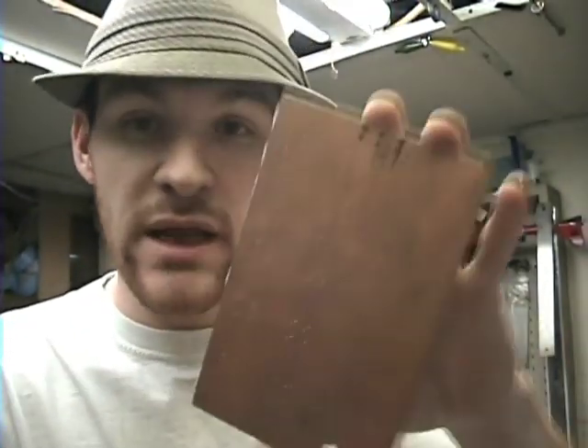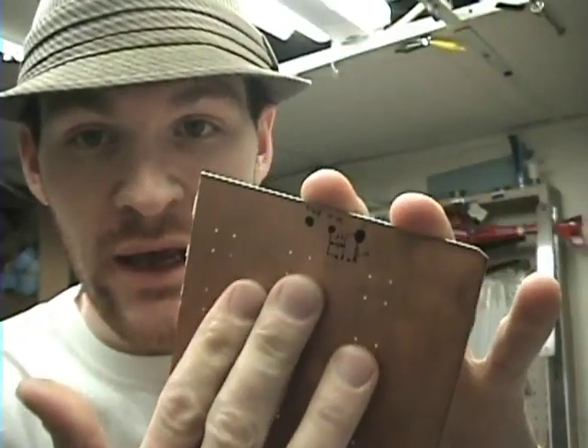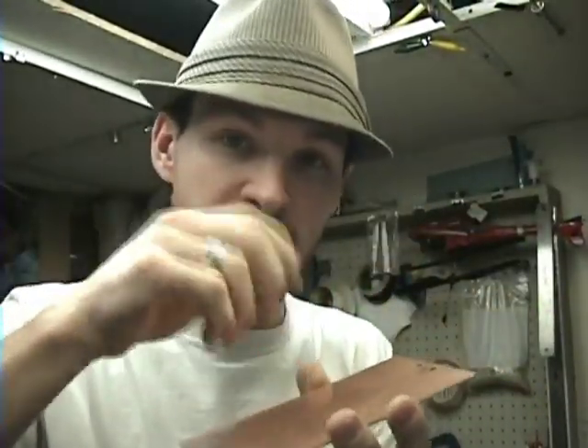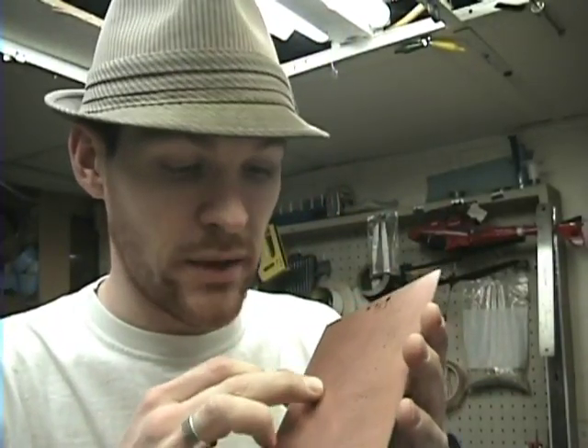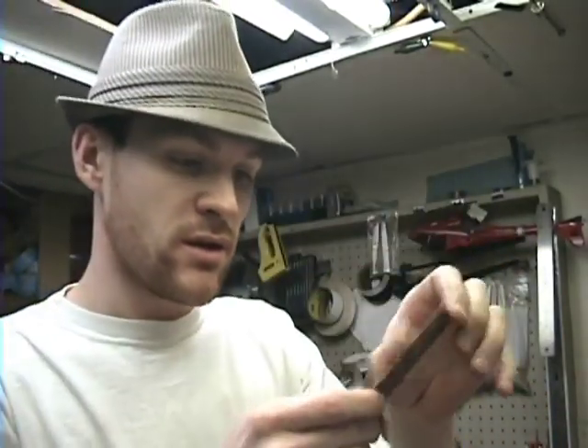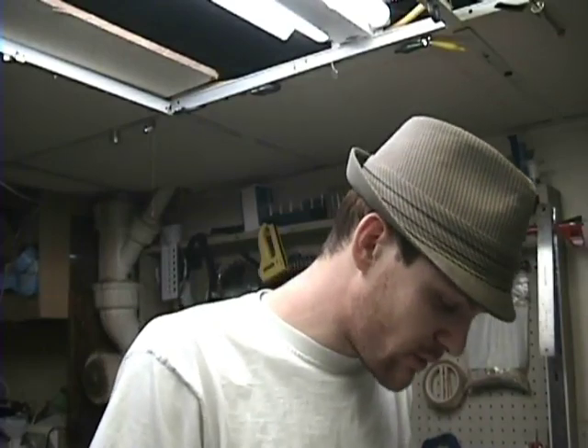Now what I'm going to do is take sandpaper and sand these smooth. If you buy these brand new you might not have to do this, but these have holes in them already. The way they stamped these out, the copper is pushed out, and when you try to put your paper on and melt the toner over to it, it doesn't work because those pits cause issues — I learned that the hard way. So I'm going to sand them off with some really fine sandpaper. The board is also pretty old, corroded, and dirty, which is another good reason to sand.